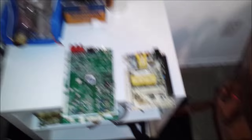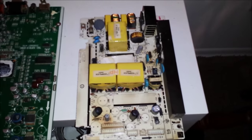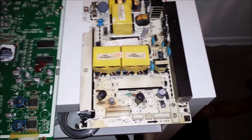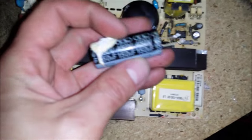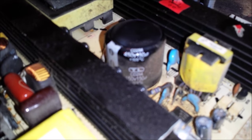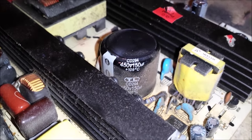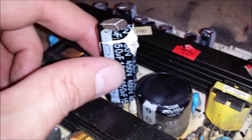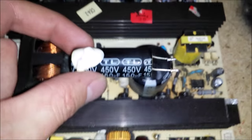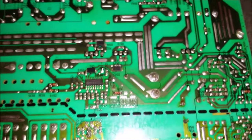Stay tuned. I had a same-size capacitor from a different LCD burnout — one that I was unable to actually salvage. This is my 450-volt, 150-microfarad capacitor, just like I need right here. But I'm running into a little bit of an issue. I think I can tuck it in and figure a way to mash it in there. So we'll go ahead and de-solder the old capacitor and slap the new one in there somehow.